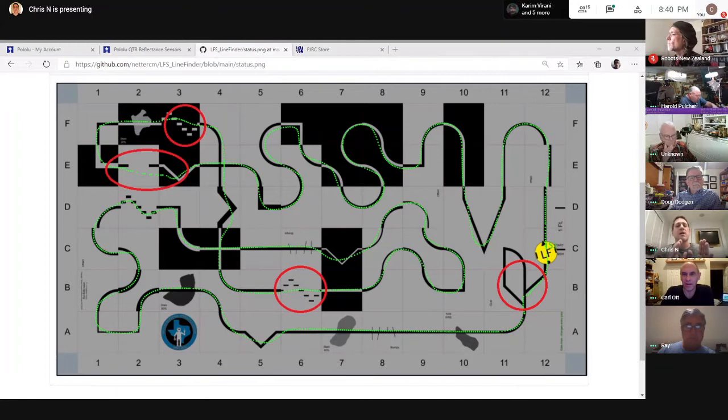So for every special place, like the acute angle, I take a couple of snapshots. Move the robot a little bit, take another snapshot, turn it a little bit, take another snapshot. So take 10 snapshots around this special place, call it a landmark. Do that for a couple of such landmarks. And now every simulation step, take a snapshot of what I'm currently seeing and try to find which landmark is the closest match. Each landmark itself consists of multiple snapshots.